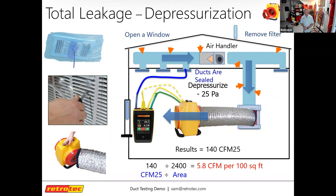The preferred sealing method is bucket mastic applied as thick as a nickel — it's messy but far more effective than tape. For a new install, plan on using bucket mastic because that's how you pass these tests every single time. Mastic tape applied to an uneven surface just won't last. Aeroseal is also an excellent option if you want a more expensive but equally effective route.